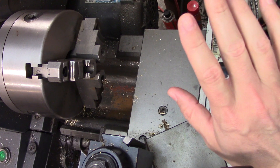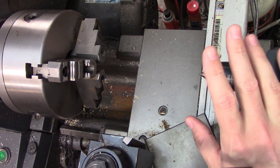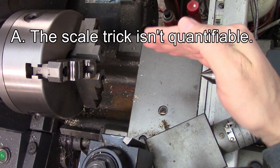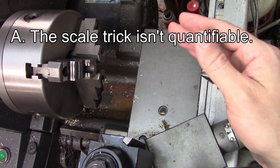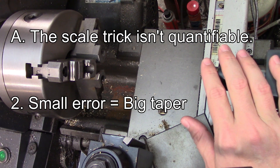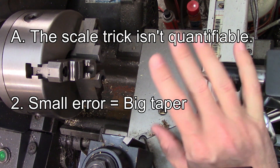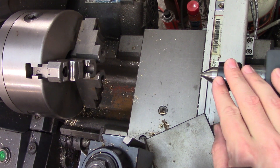Video over. Thanks for watching. Just kidding — you're not going to get off that easy. The issue is two-fold: A, the scale trick does not give you a number on how far your tail stock is out of alignment, and two, it doesn't take much of an alignment error at all to result in a big taper on your parts, so you want the alignment to be precise. Even if the scale trick isn't good for this, I do have another trick waiting in the wings to save the day.